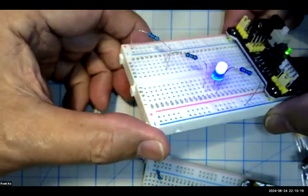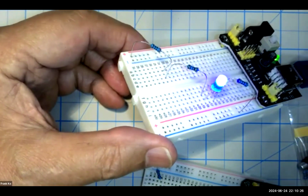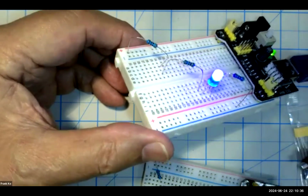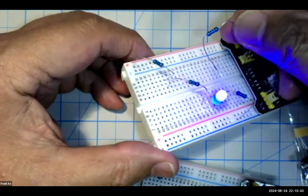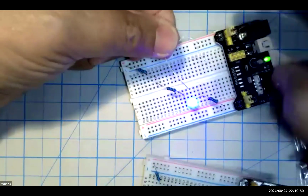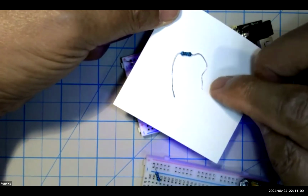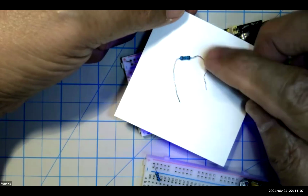Now, I caution you about this for a number of reasons, and that is sometimes when you're playing with resistors that are from our kits, because they are quarter-watt metal film resistors, they happen to be really, really tiny physical resistors, and the wires are very fine. And so when you're putting the resistors onto the board, sometimes with my big fat fingers, I might crinkle something, and that would be horrible. So for example, here's one that has been bent. Now, to try to keep pushing this into a tie point in one of the holes, this just keeps bending more and more. So this is unfortunate.